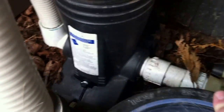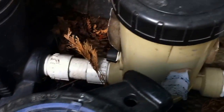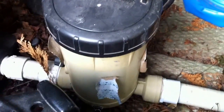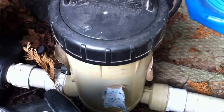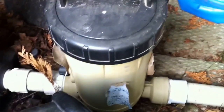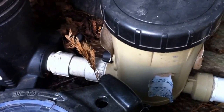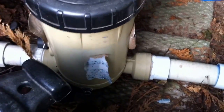I can also see there's a little bit of dampness down there, probably leaking from that winterization port on the bottom. Then we go an inch and a half male adapter, a little piece of rigid PVC, into an inline chlorinator. Inline chlorinators are good, but my only problem with them is that they're a pretty serious flow restriction. For that reason I prefer the offline chlorinator with the 3/8-inch differential pressure — one side on each side of the filter, drawing a small amount of water through, as opposed to this one which forces the entire flow of the system through an inch-and-a-half inline unit. That's probably also contributing to this pump not running with a full chamber of water.